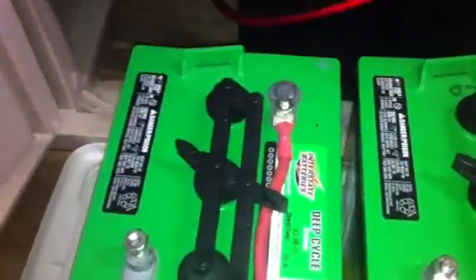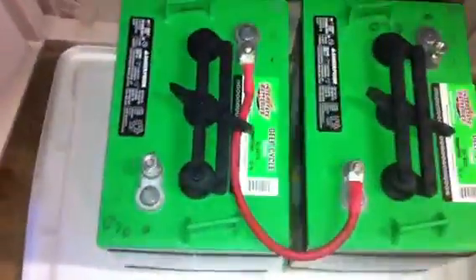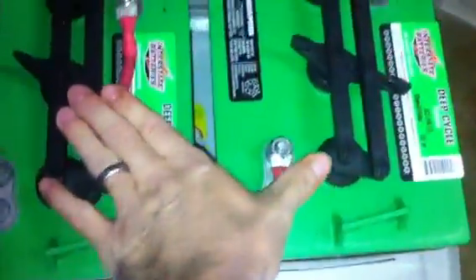You can see there's another battery bank here, also being run positive to negative, so I have another 12-volt battery combined. Then I take this bank and this bank and run them together. This is one unit in series, and this is one unit in series. Then I run these two banks together in parallel. I view each series bank as one battery — each has an open positive and an open negative. I run positive to positive and then to my load, and negative to negative and then to my load. That's how you wire batteries first in series to make 12 volts — or two 12-volt batteries to make 24 volts — and then in parallel.